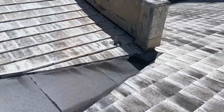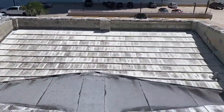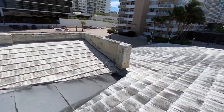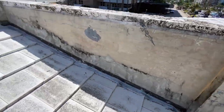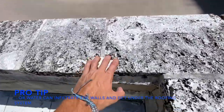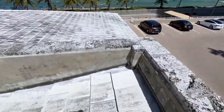You won't ever understand why architects design these little things into roofs. You've got a small wall here and all it does is trap moisture in this cricket — it gets stuck in the corners. The back side of this wall is all cracked out, and they used a very porous tile that's going to soak in all kinds of moisture. Not a good idea.